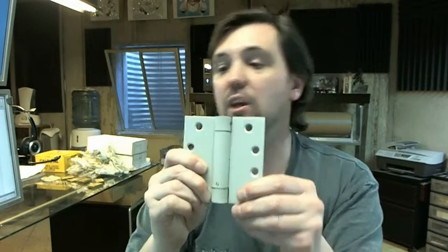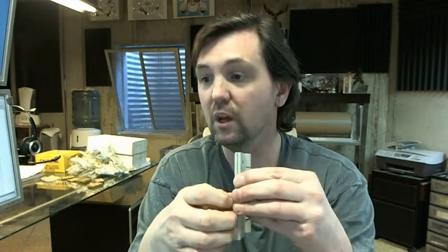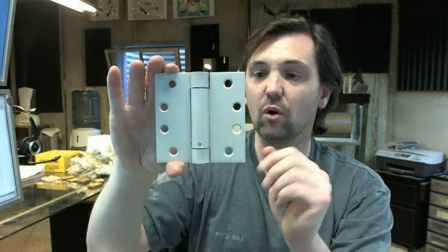There is a guide below this video in terms of the weight capacity of the door. If you're dealing with a 60 pound door, use 1 spring hinge and 2 ball bearing hinges. The axis of pivoting is also compatible with commercial grade hinges from Hager, so you can mix and match.